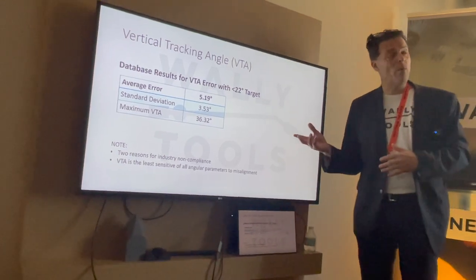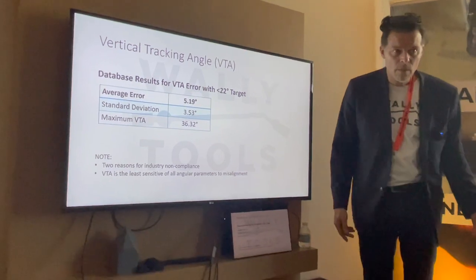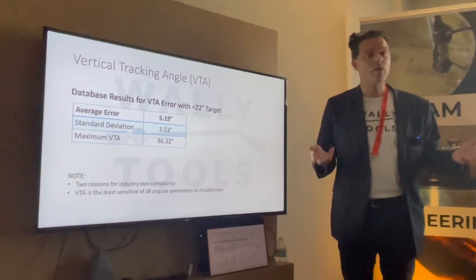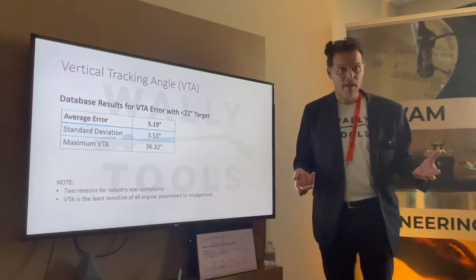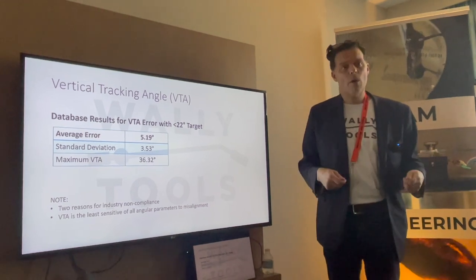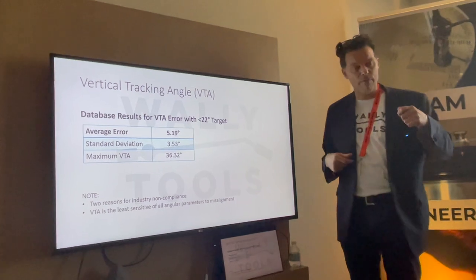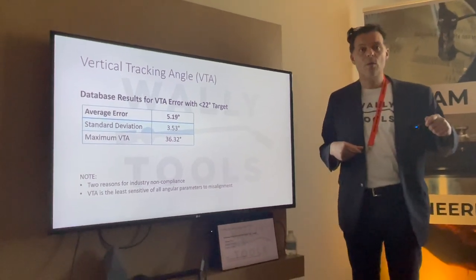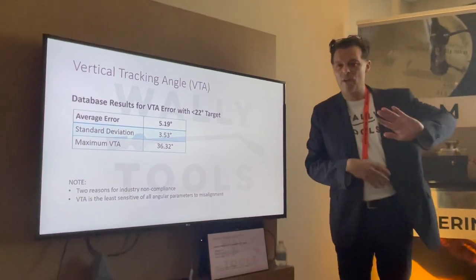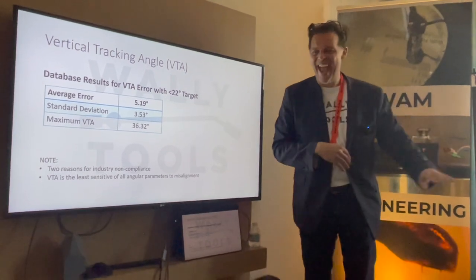Never mind, I already went into the fact that the most likely cause of mistracking is the tone arm, not the cartridge. The horizontal torque forces are out of control, okay? Plus, remember, misalignment makes mistracking easier to happen. So there's been a lot of pressure on the cartridge building industry to make their cartridges track better, even when there's poor hygiene for the tone arm, okay?